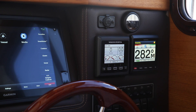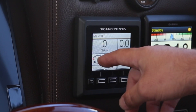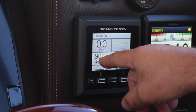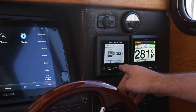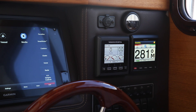The main focus today on the Volvo Penta Display is how to read your fuel level. Volvo allows you to read it in two different ways. Under your My View selection, you'll see an empty-and-full type gauge — this is the gauge we recommend you follow. Many times people will look under the fuel display and see an actual number for remaining gallons. When looking at the fuel gauge, it's important to know that regardless of whether you're looking at the needle gauge or the remaining gallons view under the fuel tab, we put the sender in the back of the fuel tank, which means when you're cruising, your fuel will be at the back of the tank, showing that you might have a full tank when you really do not.